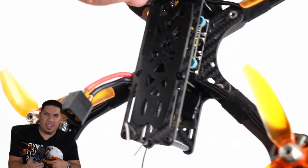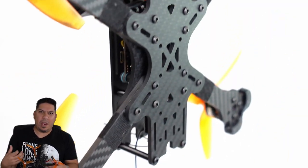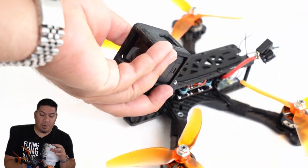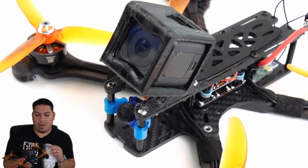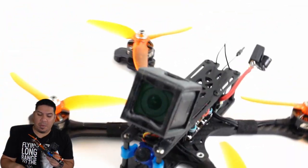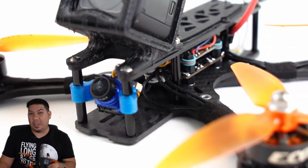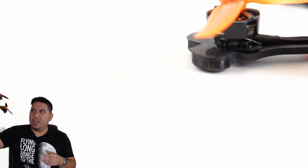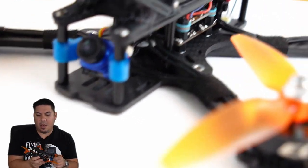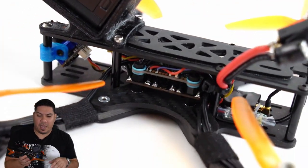And the thing is, there are two schools of thought when it comes to freestyle. There's ultra light, super powerful per weight ratio, which is kind of what I like. My Armattan Marmotte build would be an example of that because I'm using huge 2407 motors. This is kind of the other school of thought where you have a little bit of heft per power, and that extra weight. So people like Ledrib or maybe Mr. Steele like to fly with something that is heavier, some of those guys like a little more weight, some of them like a little less weight. When you have a little more weight, you can really get those nice smooth curves, that exceptional precision, and then some of that momentum that you only get by having a heavier quad will allow you to do certain maneuvers that are much harder on a lighter setup.